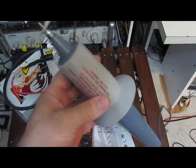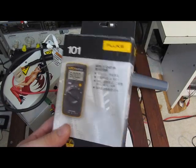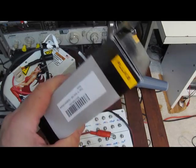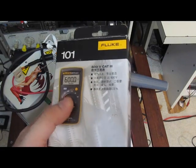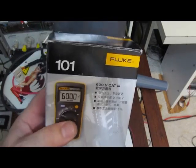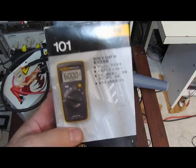I've been using this Tektronix P6013A — this is my only high voltage probe that'll run up this high — and it's got a max peak pulse voltage of 12 kV. We've exceeded that by at least a thousand volts, so we are definitely at the outside range of what this probe is even rated to handle. I probably won't do any more testing — this is the limit of what I can do with this box. It doesn't make a lot of sense to build another generator. We know it survives something over 13,000 volts at 100 microseconds. For the new guy looking for a cheap meter, this thing is very robust — chances of you damaging it are pretty low. If you just use it in the lab, the backlight probably isn't that big of a deal. The only reason I don't like the slow beeper is if I'm testing something like a PLCC and sliding the test lead across IC chips — it's definitely not good enough for that. But overall I like the meter.